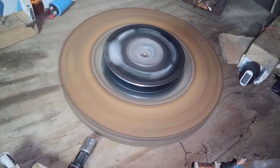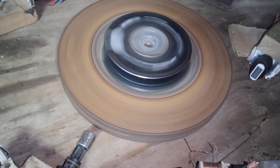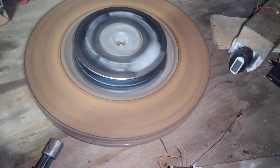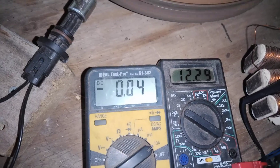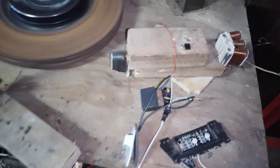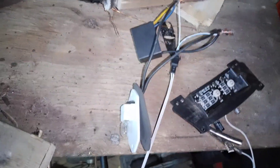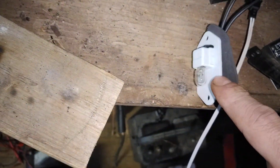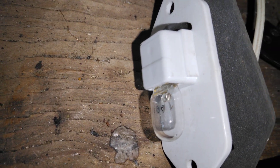It is doing roughly 600-plus RPMs. There's my output amperage on the wind turbine spinning at 600 RPMs at 5 watts. We have a trigger coil over here that I've been experimenting with, trying to get the trigger coil voltage correct for the transistors. These are LEDs over here, and this is a license plate bulb — not an LED.